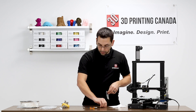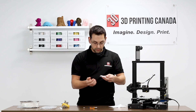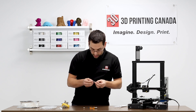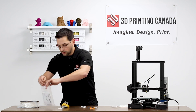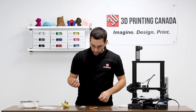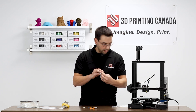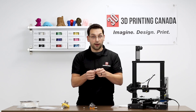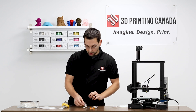There's another little bag of components: the tension spring for the lever, a couple screws, and two different drive gears. There is a brass gear and also a stainless steel drive gear. We're not going to use the brass one, which is almost identical to the Creality one with a bit more depth to the teeth. We're going to use the stainless one — the teeth are a little bit finer and not quite as deep, but there are more of them as a result.